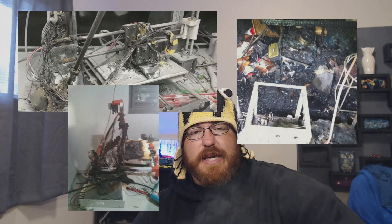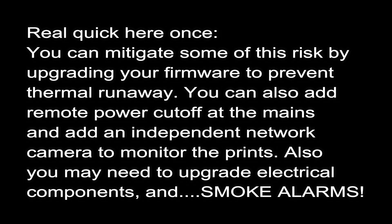I chose the foil because, you know, 3D printers and fire happens. There's always an inherent risk in 3D printing with fire. Naturally the thing heats up — it's a 3D printer, it's got to get hot to put out plastic. So I used a rigid insulation with a foil covering for a little higher fire rating on it, and I'm okay with it. I've come to terms with it.